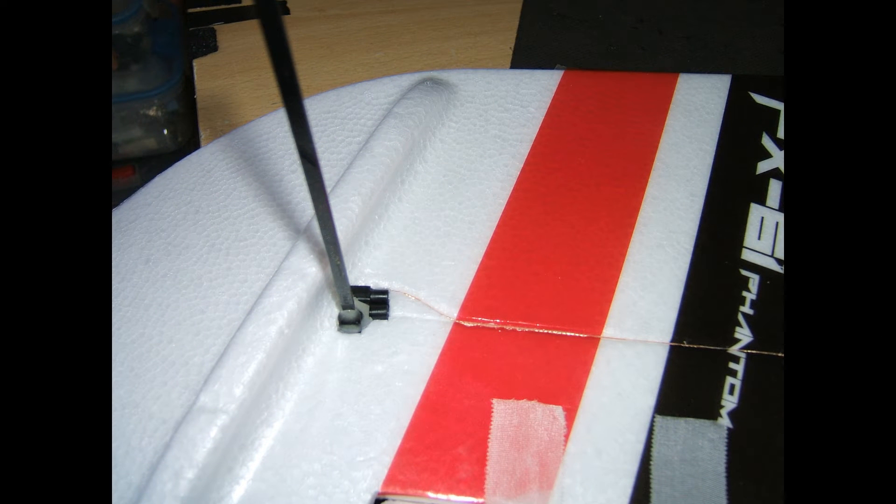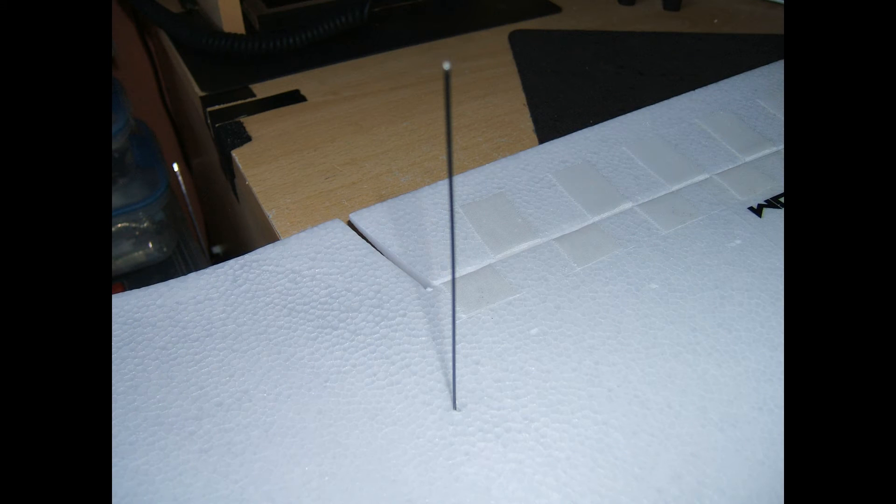As I'm using UHF for control on this model, I built a half-wave dipole fitted near the tip of the wing beyond the GPS receiver. The bottom half of the dipole — the part below the wing — was made flexible by using the inner conductor from RG58 coaxial cable. This was glued to a strip of flexible plastic taken from a zip-tie, allowing it to fall back on landing and simply spring back vertical into place again when picked up. The top half of the dipole is stiff and was made from oiled pushrod made of spring steel. The coaxial feed line is fed along the wing and into the centre section for connection to the receiver.